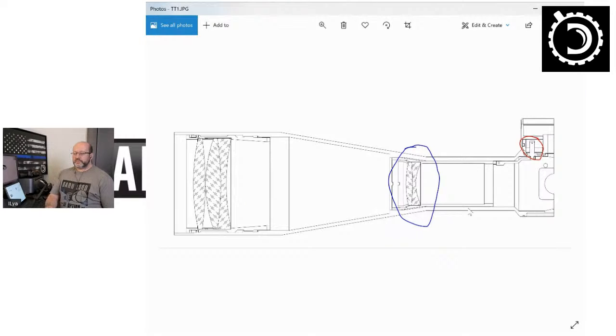An actual question is that, well, why not leave a lot of space there? For several reasons. The biggest and obvious reason is that if you leave a lot of space, you always run the risk of something tilting, which will wreak havoc on the image and parallax and all sorts of other stuff. And also you have to be really careful with something called a reticle hop under recoil. When the gun is fired, you don't want these lenses to be moving up, down, left, right, that kind of stuff. So the tolerances there are quite tight.